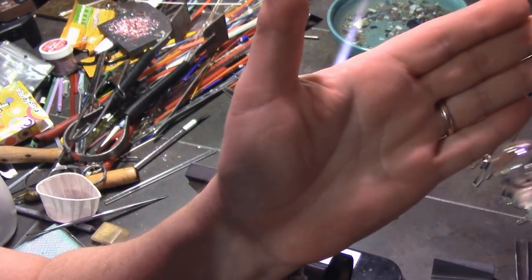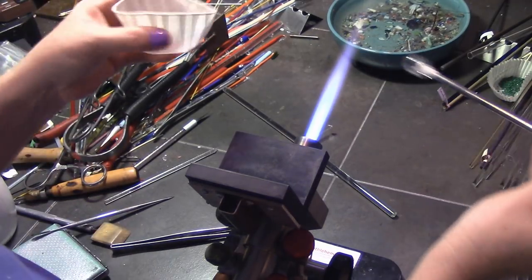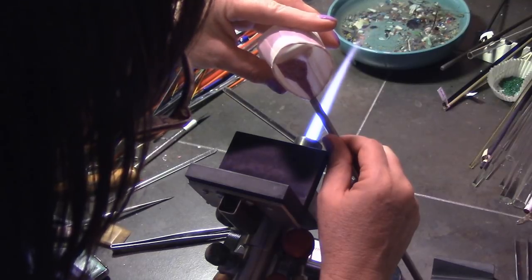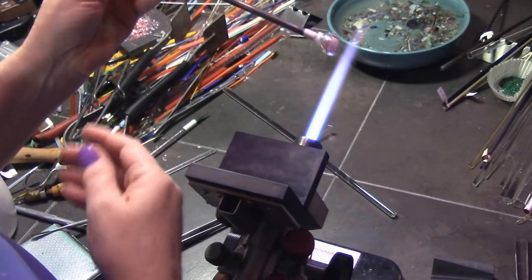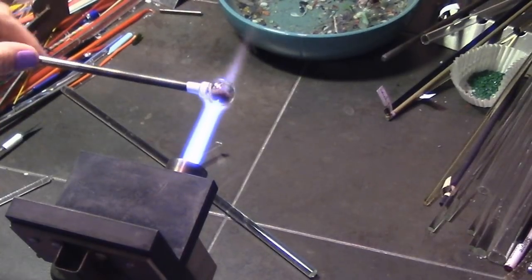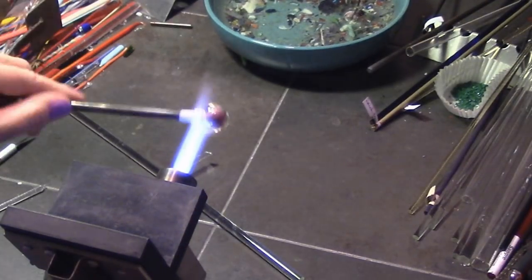I have a nice little ball of clear glass there. It's fairly thick — not totally blown out as far as it's going to be in the end — but I want a nice bubble to hold this frit. So I just pour it in. If you have a little funnel, that's great too. You just have to make sure the frit will fit inside and flow down to get inside your ornament. I tap it very gently just to make sure all that frit is down. I have it about a third of the way full. Now I want to gently heat, spinning very quickly so I gently heat the whole ball so the frit will stick all the way around and won't get stuck to just one side.